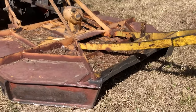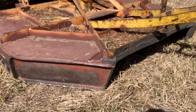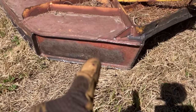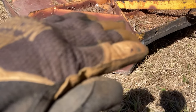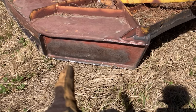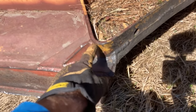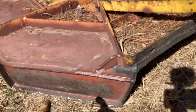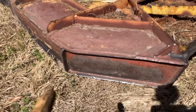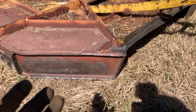Probably the most important thing on this brush hog is this funnel — this piece of metal about 18 inches long that comes in at an angle. On a standard brush hog it will bend under when you hit things, and when it bends under it hits the blade. That happened to me for a long time, so finally I had this whole side rebuilt. All of this metal — this gusset, the metal down there, and the metal it rides on at the front corner — is all extra metal, and that keeps this funnel from caving in under the brush hog.